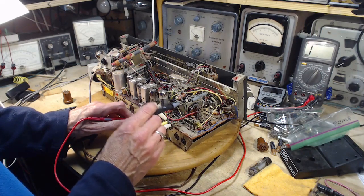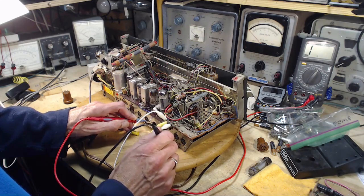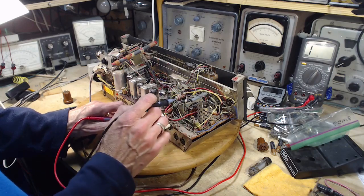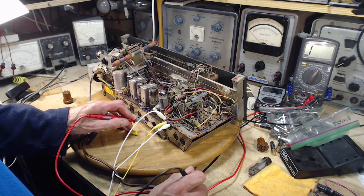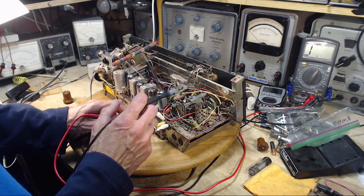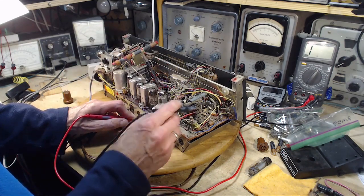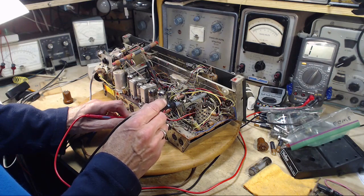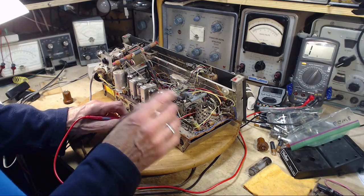The only way this thing can burn is pulling power through here. It's not hooked up to anything else. It's got to get it through these capacitors. And it's not, okay, so now it's burned open, of course, it's not hot anymore, and it's not pulling this point down to ground as it would if it were shorted. No, it's not going to short, what am I talking about?